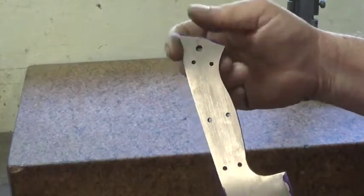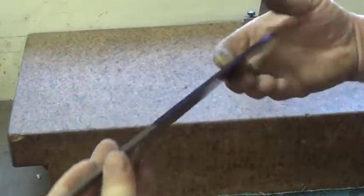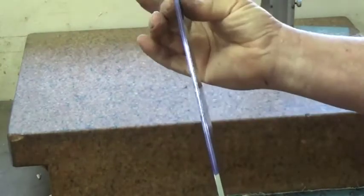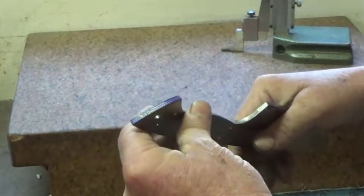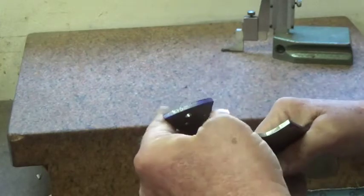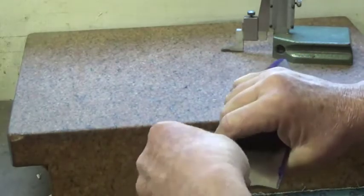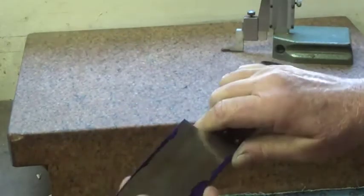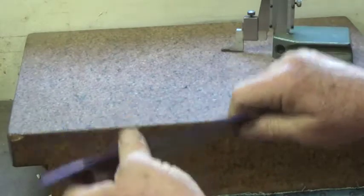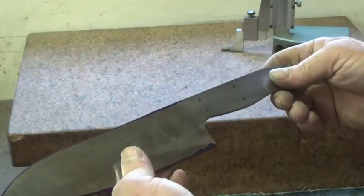I'm going to do a center line at 75 thousandths to give me a line to follow, and then set for laying out my tang taper. I've gotten my centerline scribed down to guide me as I taper from here to the point. I want to go down to about a third of the original thickness as we get back to the handle, so I set the height gauge for 50 thousandths and scribed two lines - that's going to leave 50 thousandths in between, or a third of the original thickness. That is going to make this knife lose the weight and become something that's still relatively light yet strong. We're going to get started grinding in just a few minutes.